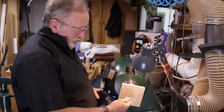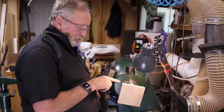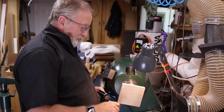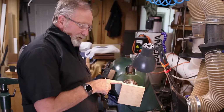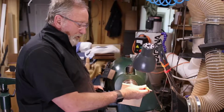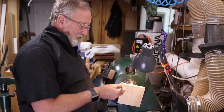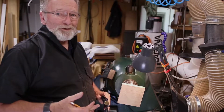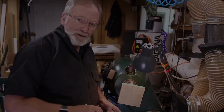So we'll cut in this direction, and then as we get very close here, we'll cut back into the bowl on the other side. So easy peasy. What I learned is if you cut it too high up here thinking you're going to have a thicker bowl, you can't create the arc in the bowl that you want because it's too thick. So I've calculated out just about a 1/2 inch does the trick. Of course, the real trick is that you don't exceed that and go past it. Okay, so let's set up again.